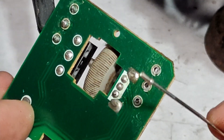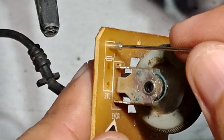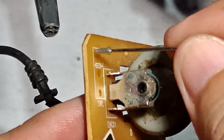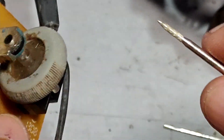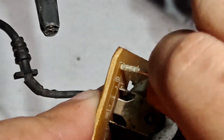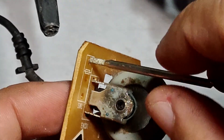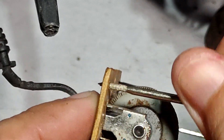Before you insert the Milmax 0305, you'll notice you can't insert it directly, so we need to drill a hole here until we can insert this Milmax socket. We need this drill bit tool and we will manually drill it by hand so that we don't overdo it. It's up to you if you want to use a power tool, but I prefer to do it manually.